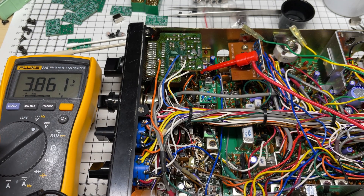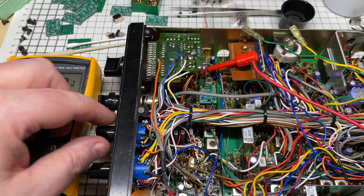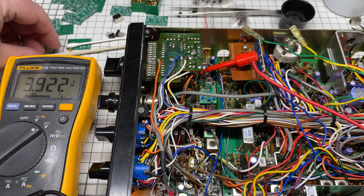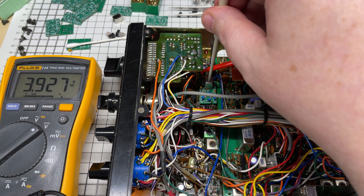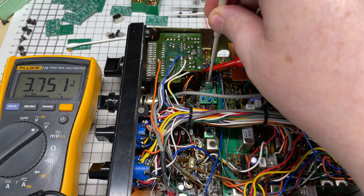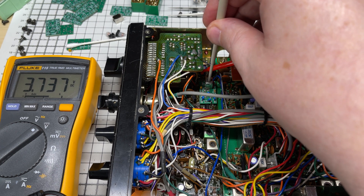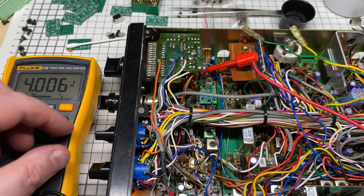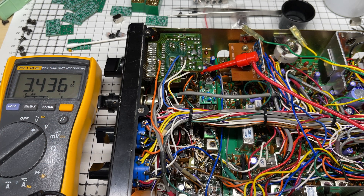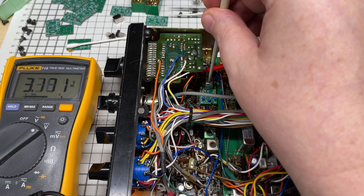After a bit of work I found out that I had too many windings on my coil, and also the circuit board was wrong — I'd put a trace in the wrong place. I've corrected that on this board just for testing purposes, and we now have a working VCO and a working coil. It ended up being 12 turns instead of 15 — three sets of four — and that works beautifully. The VCO voltage is now nice and steady and we can adjust it correctly.